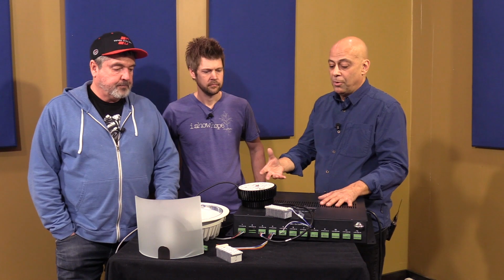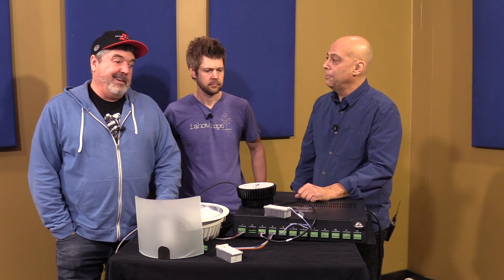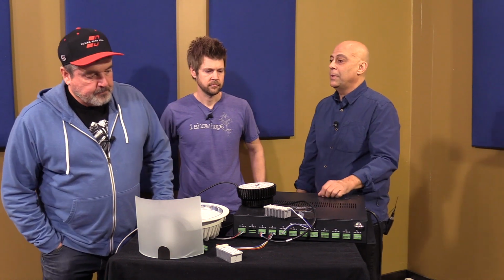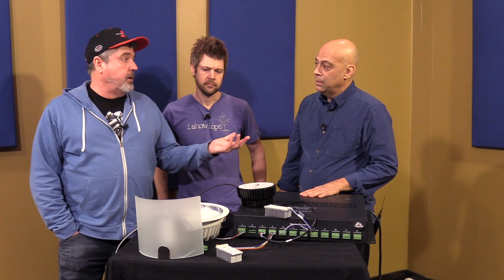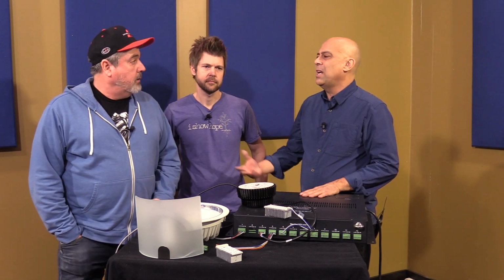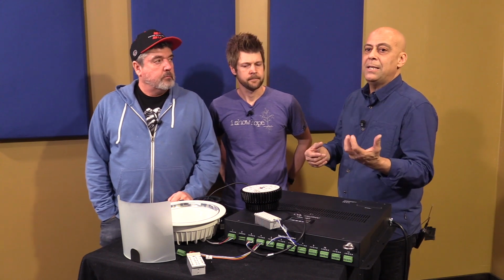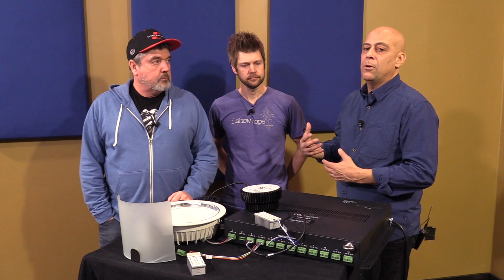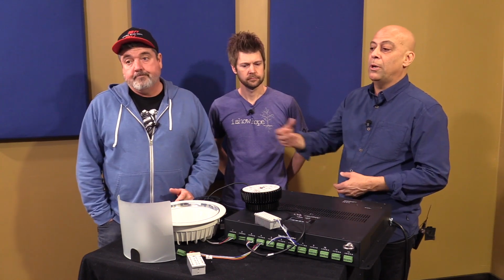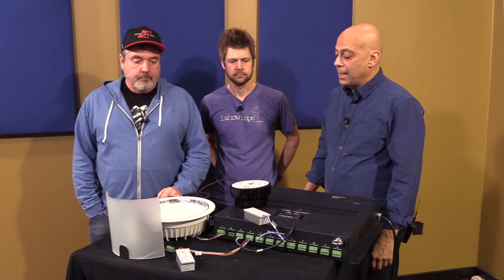And it works for them because anybody can run speaker wire, 18-gauge wire. Easy to do. You can buy it at Home Depot, Lowe's, or Menards. It's not a specialty wire. We can also help you get a wire that's an 18-6, which means 18-gauge, 6 conductors, with an extra in there you don't need. But it is so cheap, and it comes in a 1,000-foot roll in a box where you pull it. You just run it quickly and wire it together.